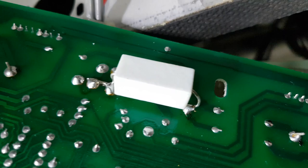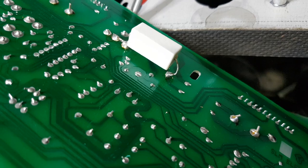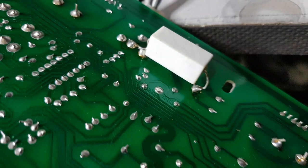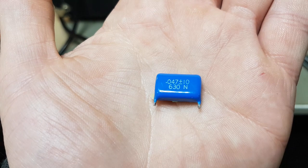This is interesting - R46 should be a 470 ohm 5 watt resistor. But R46 here is 1k 5 watt, and on the other side someone's put another 1k in parallel with it. So instead of buying one of the most commonly used 5 watt resistors on the market and stocking it, they've used two 1k resistors in parallel and tack-soldered that on the back. Lovely.